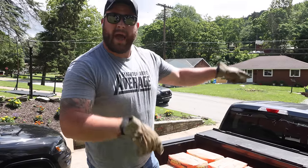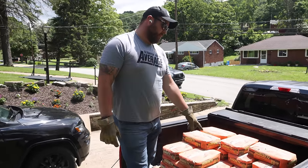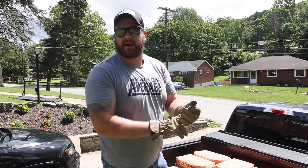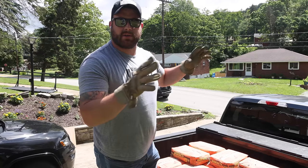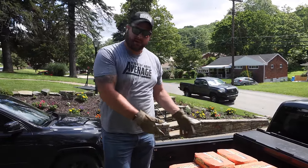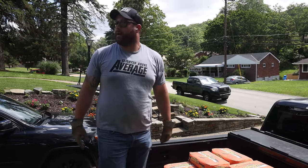So to change it up a bit from the patio, we're going with bags of concrete here. We're mixing up some Quikrete commercial grade, crack-resistant for the stairs. It's got some fiber in it and a couple other additives to help make sure it doesn't expand and contract and blow itself apart. But you're going to want to check your local building codes and local recommendations if you're going to attempt a project like this one. We just now need to hump 60 bags of concrete to the backyard.